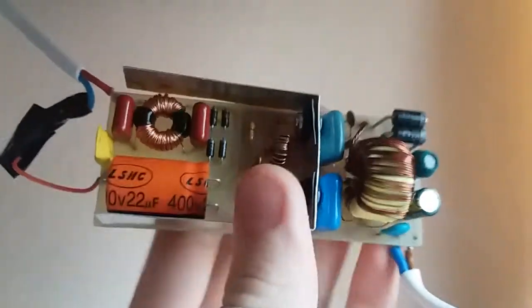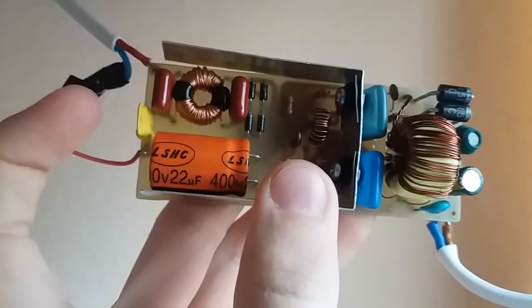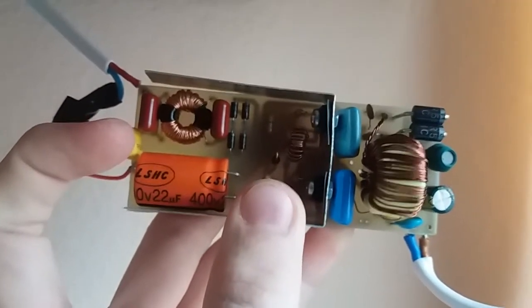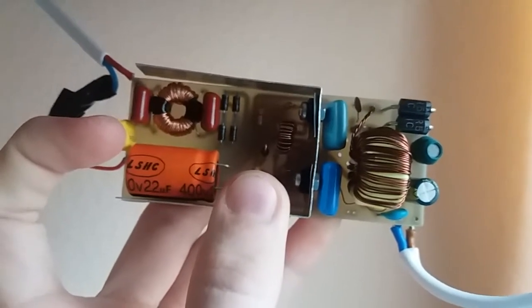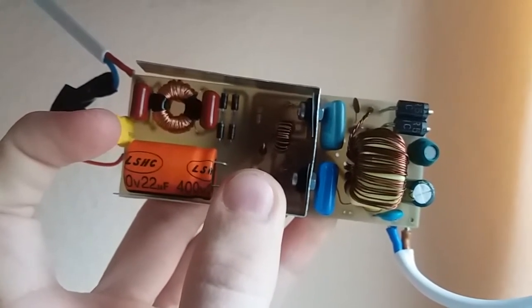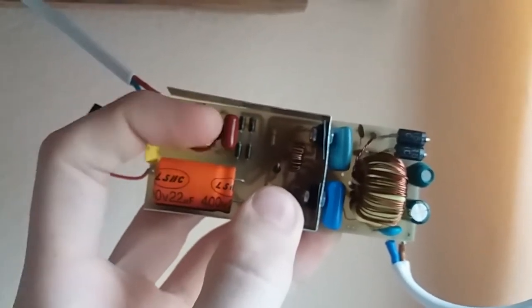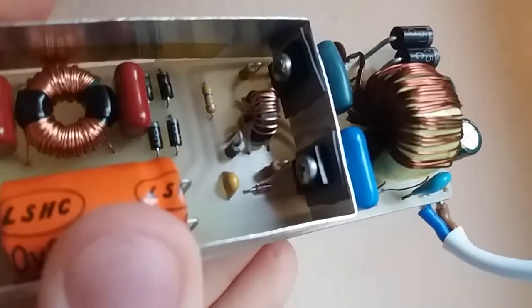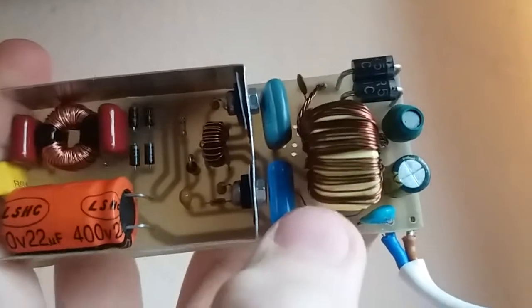So that's the power supply in all its glory. You can see a fuse that's just stacked in because I used it for a previous supply. Here is a 10 Ohm fusible resistor, which acts as an inrush limiter and a fusible link — that's in case I did not have a fuse here. Here you can see a capacitor, choke capacitor, interference filter, a bridge there, 22 microfarad capacitor, a couple of resistors, capacitors and bits and bobs. Feedback transformer, two other capacitors to form a half-bridge.